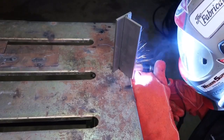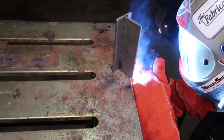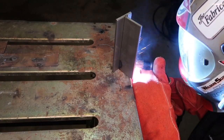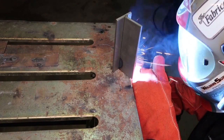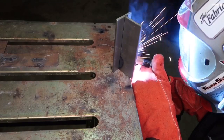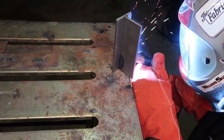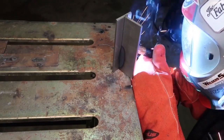The next joint set up with 95-5 oxygen is on a quarter inch mild steel plate, vertical up, out of position, fillet weld. You hear that sound? Very smooth. But I'm having some problems because with the 5% oxygen, it makes the puddle more fluid, and it's very difficult out of position, especially if you're not running in a pulse mode. I'm using the same settings: 280 inches per minute, 17.9 volts. The toe is not wetting into the sidewall, so I'd probably turn the volts up.